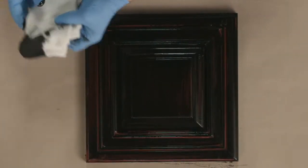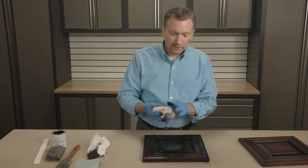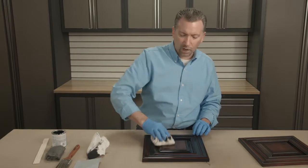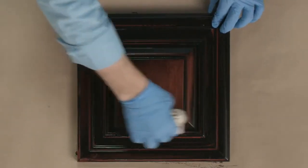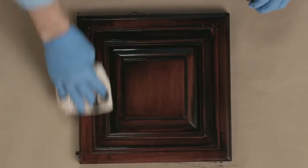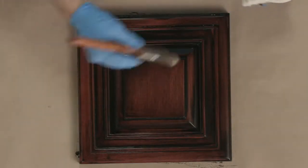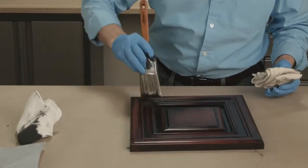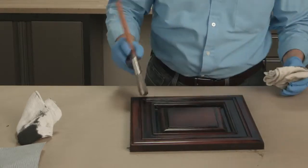Then I'll begin to do what's called a soft wipe — it's just like wiping a regular wood stain, but instead of scrubbing it, I only want to do a very soft wipe. I want to take off portions at a time. What that does is it allows the stain to hang up naturally in the crevices and creates a beautiful burnished edge. I'll take a brush and simply smooth that out. This is a technique we call brush blending, that moves the stain around and blends the second stain color — the antiquing stain color.